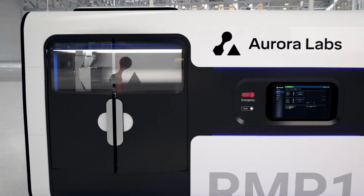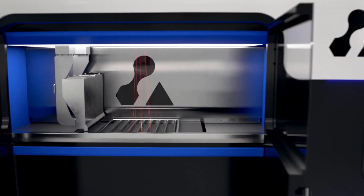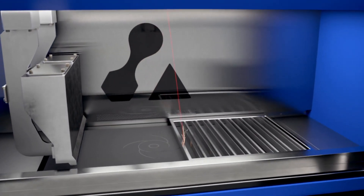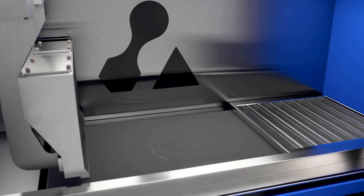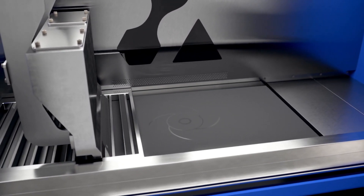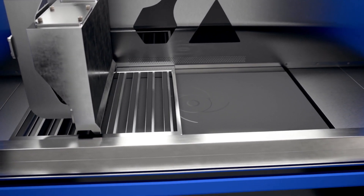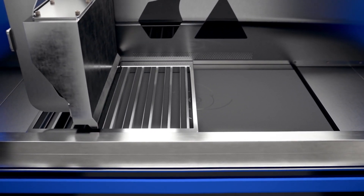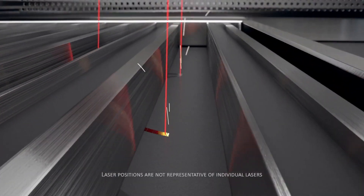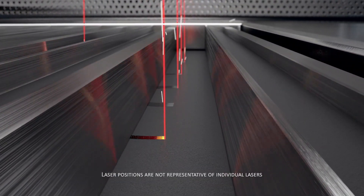In place of a standard single sweeper, a gantry comprised of sequential powder gates — each with a dedicated sweeper — spans the build area. There is a gap between each gate where powerful lasers can melt the metal powder, creating the part. Powder is loaded into the gates from the main powder hopper, and the MCP gantry begins its sweep across the build surface, laying multiple layers of powder concurrently.